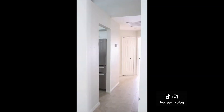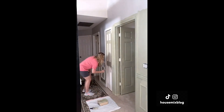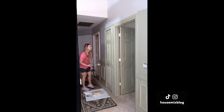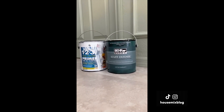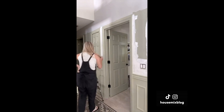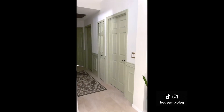Finally finished painting the hallway after four months. I had previously installed wainscoting with pre-made forms and chair rail. This year I painted the doors and trim Benjamin Moore Sage Wisdom — bonding primer first, then semi-gloss enamel. I decided on Benjamin Moore Paper White for the walls. I also painted these old hinges black with an artist brush — it adds detail and coordinates with the door handles.